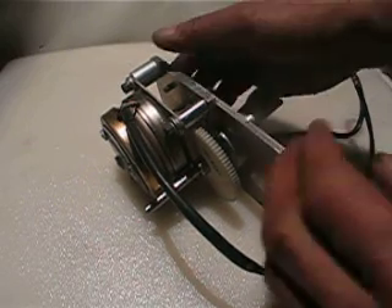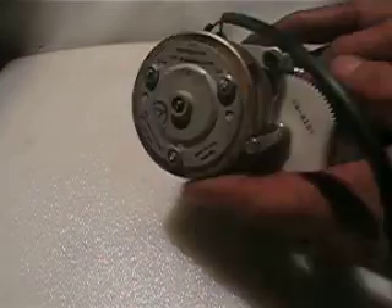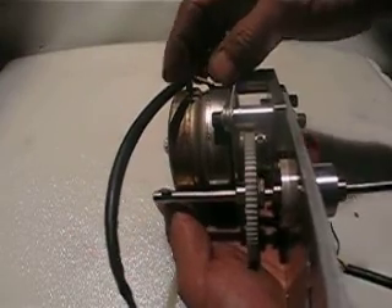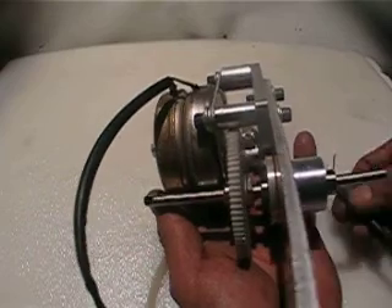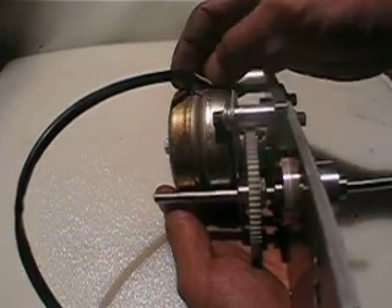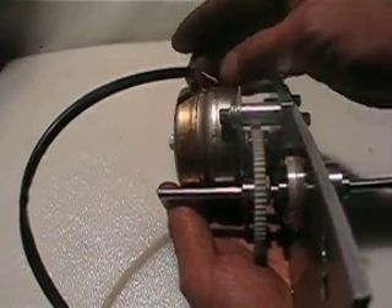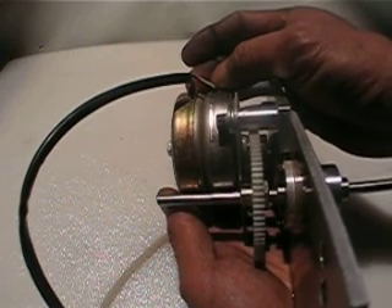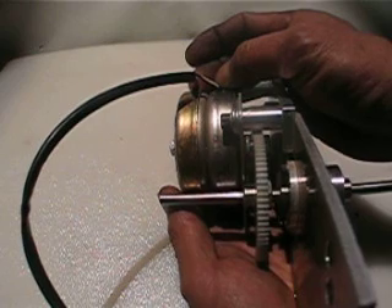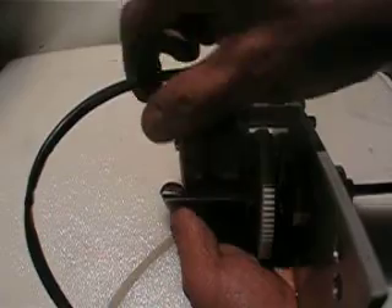Hello everyone. What I'm selling right now is a combination stepper motor. I made the test — it's a 2-phase bipolar, but no center taps. So you need a driver which is just A-plus, A-minus, B-plus, B-minus. No center taps.